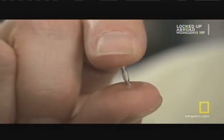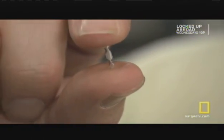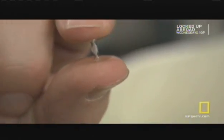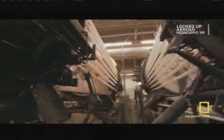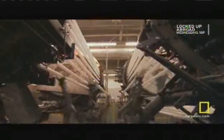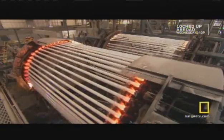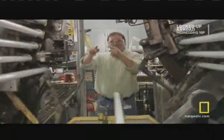The most important part of the mount is the capsule, which contains just 1.7 milligrams of mercury — less than a pinpoint. This tiny capsule is all you need to light up a fluorescent bulb. A machine attaches the tiny mercury capsule to the mount. Once the capsule is placed, the sealer adds the mount to the end of the tube and melts it on, keeping the electrical wiring stable inside the bulb.